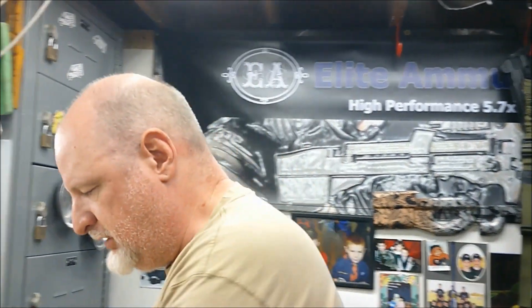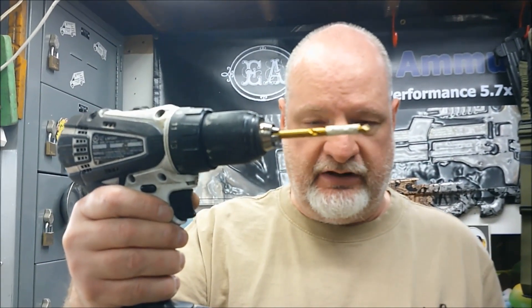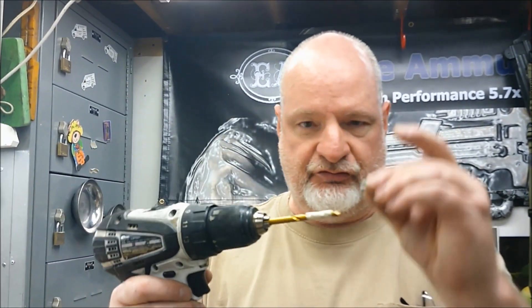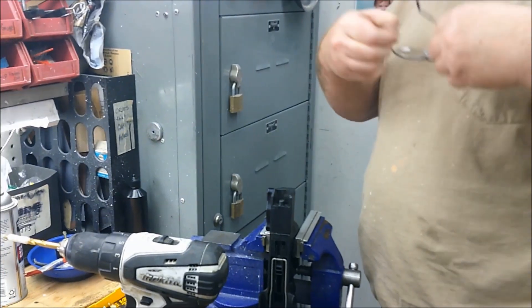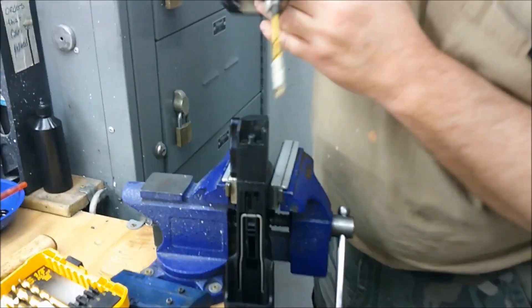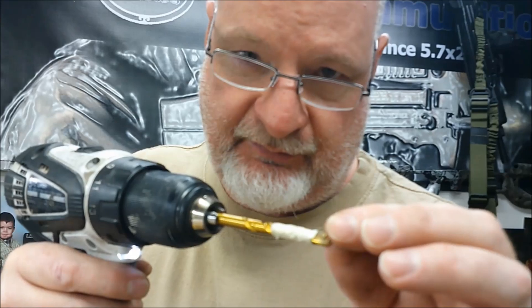You have to supply your own one-and-a-quarter inch drill bit. What you're going to do is put the insert next to it and tape it off so you don't drill too far into the stock, but you want to make sure you drill far enough to seat the insert all the way. Drill on low speed because this is polymer — the drill bit will bite and dig in, so go nice and slow.